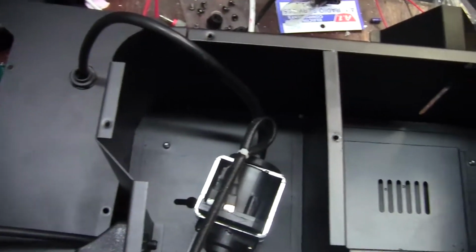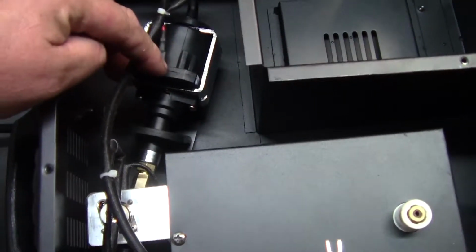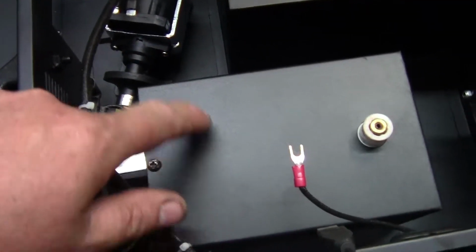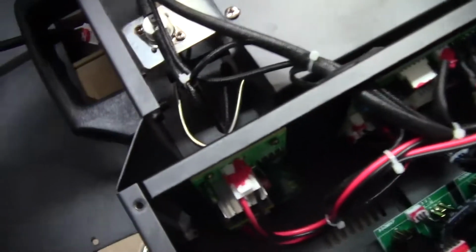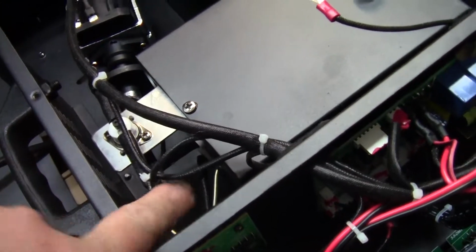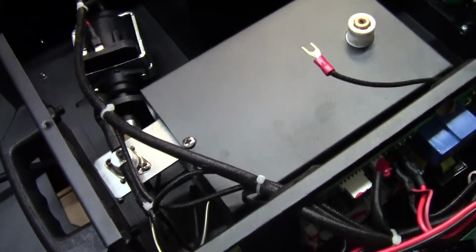Okay, I'm going to take your handheld just so we can go through basically how this machine operates. So this is your inlet pipe from the cylinder that's got the smoke fluid in it, which is a water-based glycol mix. It then comes into this solenoid-based pump here, which pumps into your heater block. And then the heater block heats up the oil till it vaporizes, and then it comes out as the steam or the smoke basically. If we look over here, we've got our thermal cutout on the heater block, and built into the heater block we've got a thermocouple probe to check the temperature and make sure it's not too high, that it's burning the liquid, and not too low, that it's just going to squirt out the liquid.